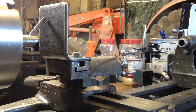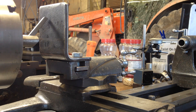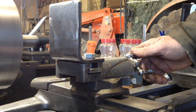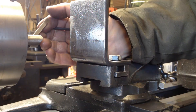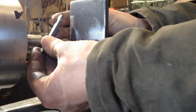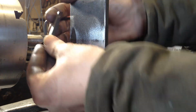I do not have the cutter sharpened at this point. I'm just going to give that a quick try for kicks and grins without it sharpened. I knew I sharpened it wrong — I wanted it flat this way, but instead I sharpened it down. I still might be able to get by that way. I'm going to try it. I think that might be enough relief behind it.